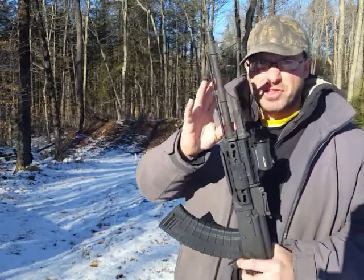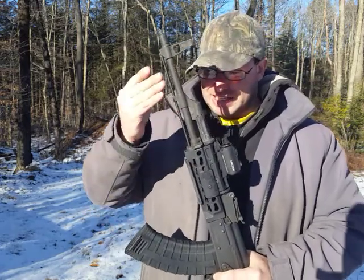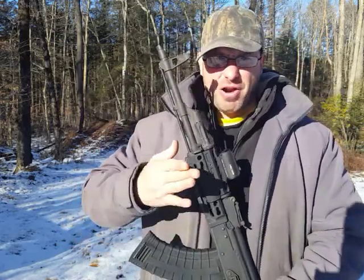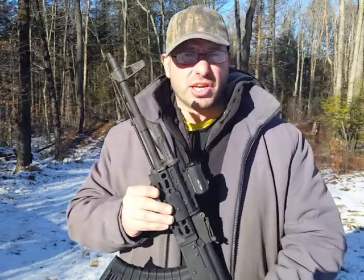Because when you fire the gun, the barrel flexes a little bit — there's a little bit of flex — and it's flexing through that clamp. So after a few hundred rounds of that barrel flexing, what is likely to happen is that the clamp is gonna start loosening up.